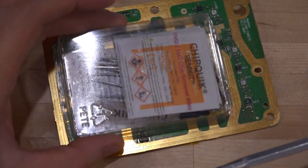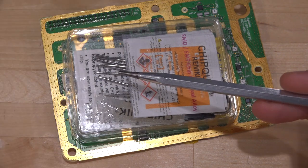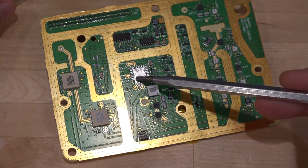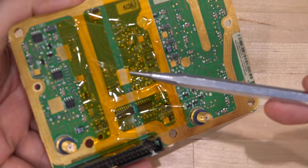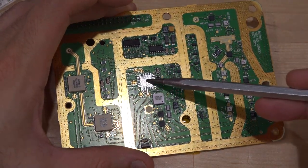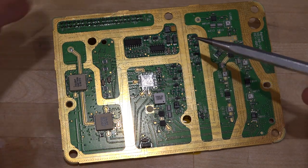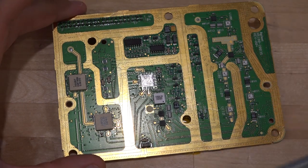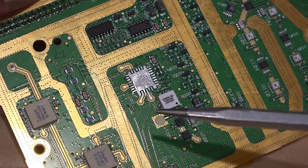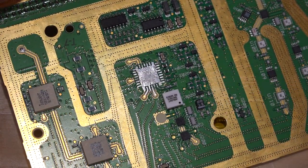The other possibility is to use chip quick solder. These are amalgams — somewhere between liquid metal and actual solder — and they have a very low melting temperature. If I put a little bit of that over here and heat it up with a soldering iron from the other side, I should be able to keep it in a liquid state, then press the chip on top just enough so the bottom is soldered with a good thermal connection. Then I can go around with a soldering iron and attach the corners. That should hopefully give us a good compromise between not having to reflow the whole thing and not subjecting this to any more temperature fluctuations.